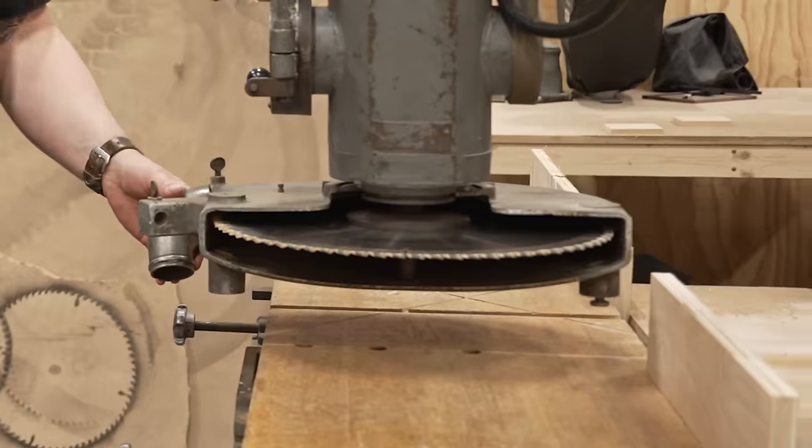The problem with all of this, if I wanna use the saw like this and I'm feeding this material, you can easily see how I might get hurt. I'm pushing into the blade and then I'm pinning my arm with very little room for clearance to the blade itself, because the whole blade's up. When the table saw, it's down. Incredibly sketch, just gonna say.